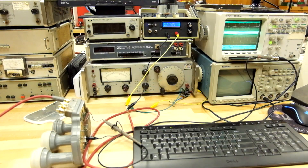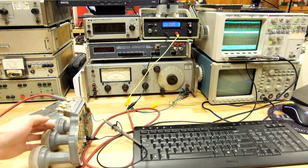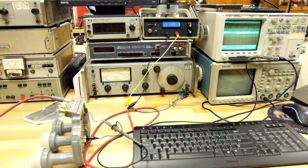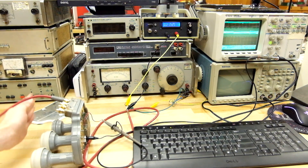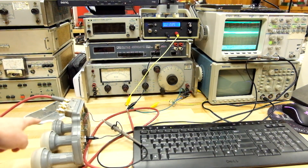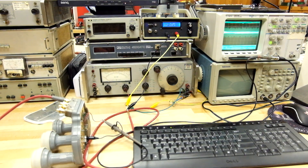It's powered up and hooked up to the oscilloscope in the top right corner. As you can see, when I put my hand in front of the feed horn, you'll see spikes in the output. That's what we're using to measure. All we have to do is put an object in front of the feed horn, move it towards it at a known rate, and then measure the frequency of those pulses coming out of the mixed output of the LNB. Then we plug that into an online calculator, and that will tell us the speed.